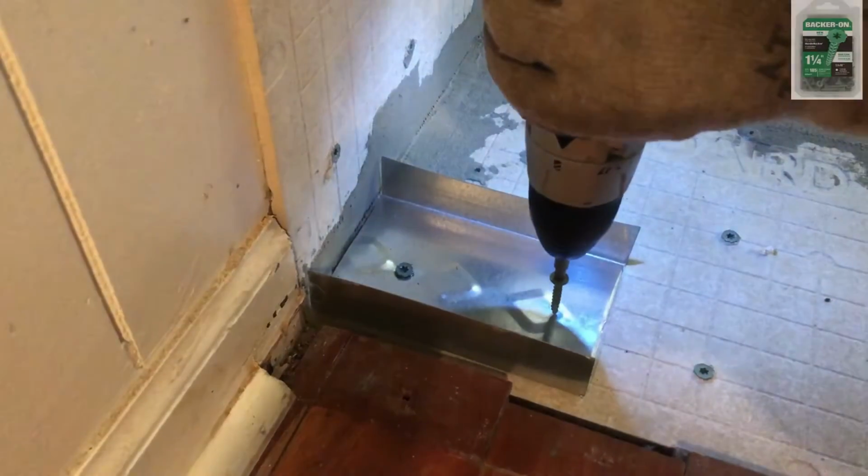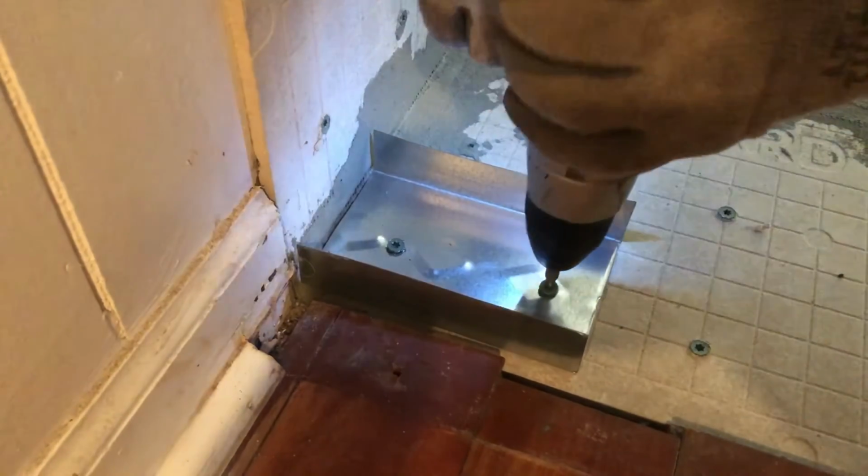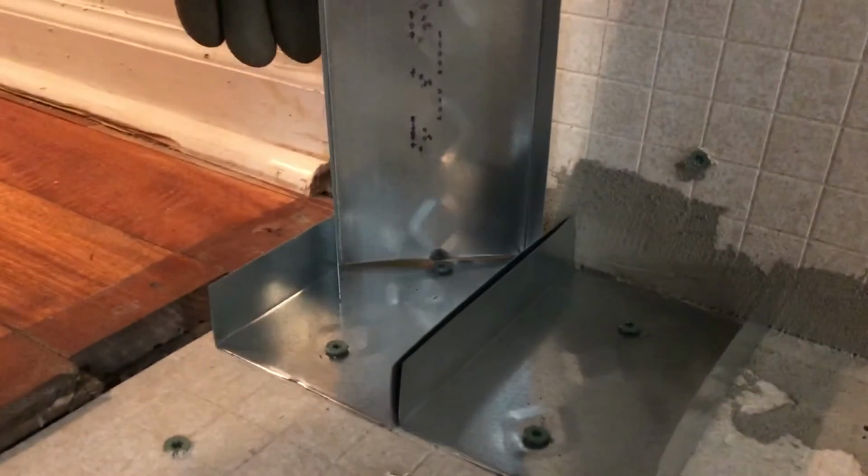This short piece that I cut becomes a track for the upright steel studs. Then we attach the track to the underlying concrete board with concrete board screws. We place two tracks next to each other to get the right width for the column. Steel studs are placed vertically by first putting them at an angle and twisting them into place.